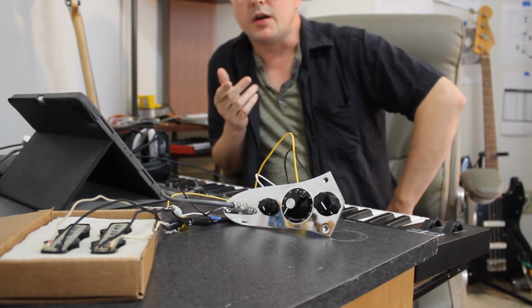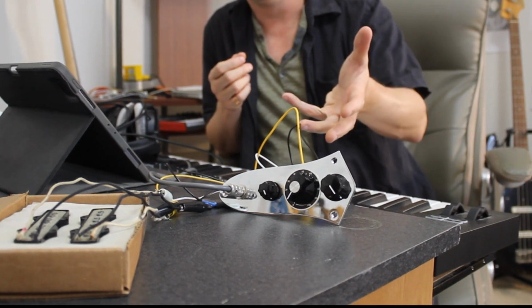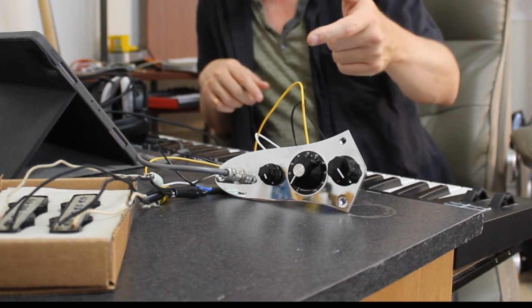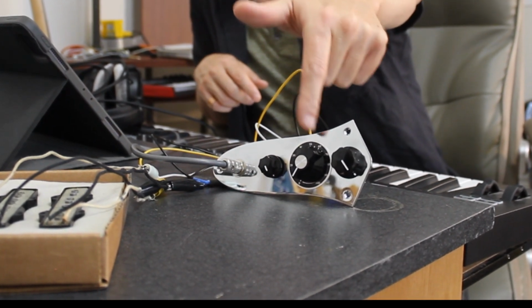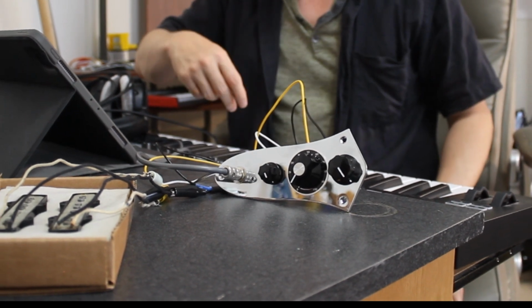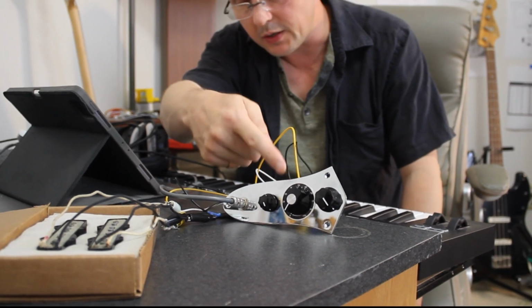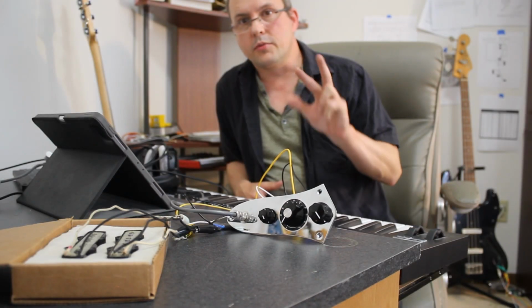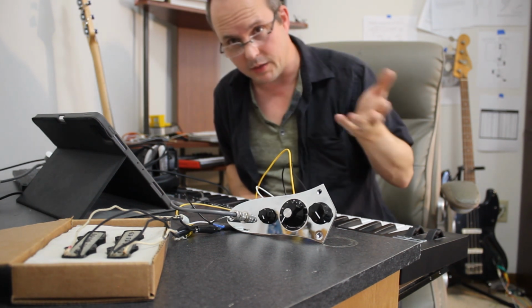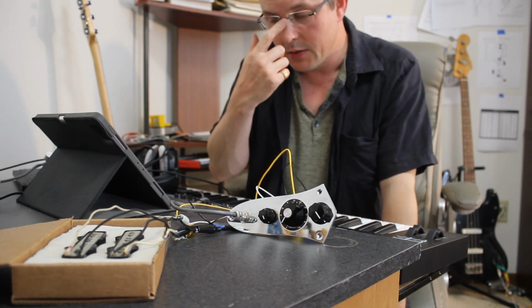So one of the first modifications that people do to their jazz bass is having something like a blend knob or a blend circuit, going from volume, tone to master volume, blend knob, tone. So instead of having to use the two volume pots to get the blend that you want, it's just simplified into one. Three things are different between this and your standard blend pot that you can make yourself from online schematics.